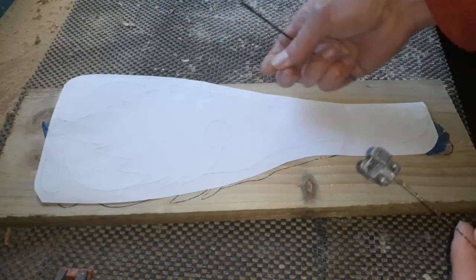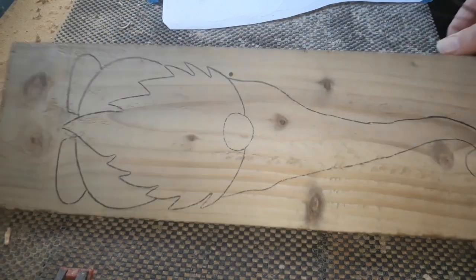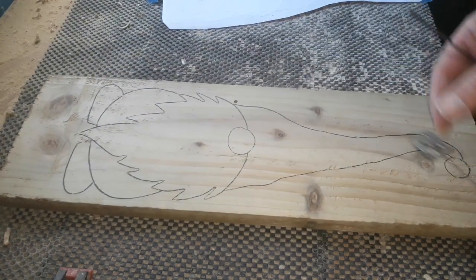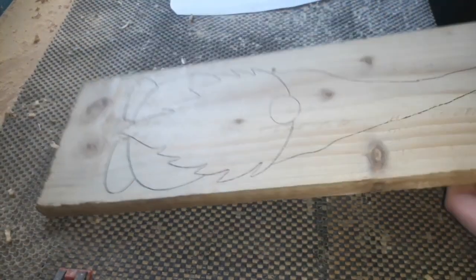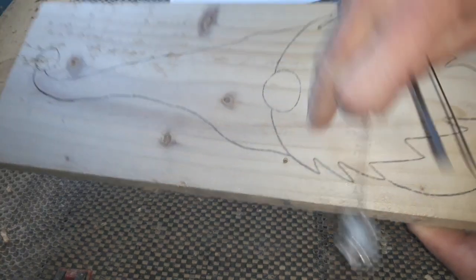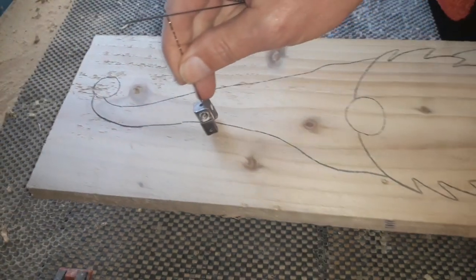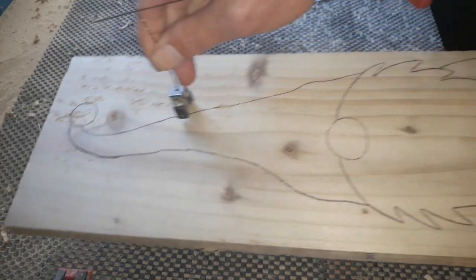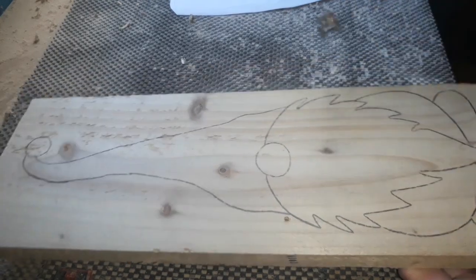So if you're doing larger projects where you're struggling to get the big piece, obviously not today with this little 15-inch one, you could put that on, set that into that hole there that we're going to do. If I just turn this around quickly, we will put that into that hole. That's what they call a pilot hole. You feed the blade through, and we can literally just go from left to right and cut that out like so, all the way around without basically even turning that wood.